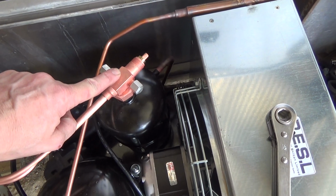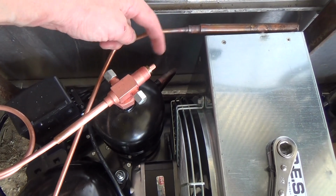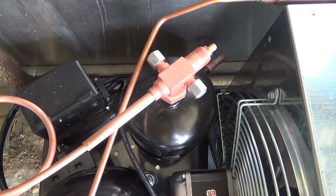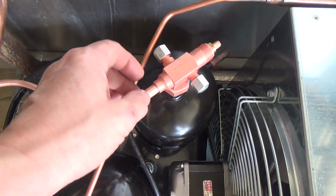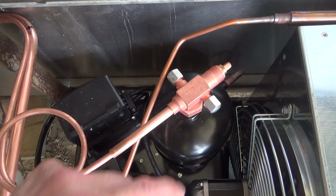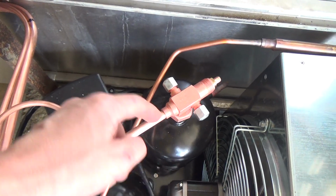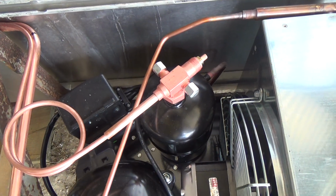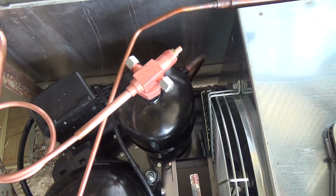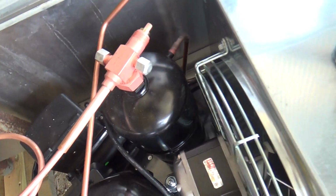When you let the gas and nitrogen out, at least to braze them, always crack a port open on the side. Don't just open the stem out first, because that will blow a load of oil out the pipe and it will contaminate where you're going to be brazing. I mean, these look like they're bone dry. Some of the silvery coloured ones have oil on them, so you have to degrease them first. Good thing with this is, because it's copper plated, we can just use normal 5% or 15% silver rods without having to use flux. I mean, you can silver solder them, but you're just making work for yourself.